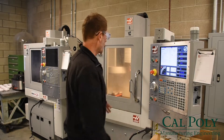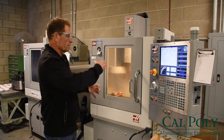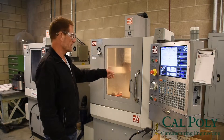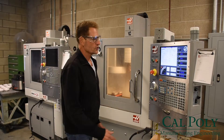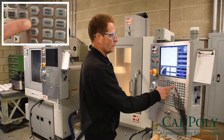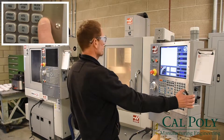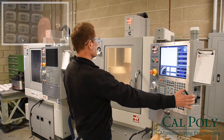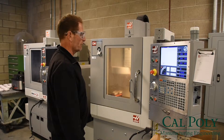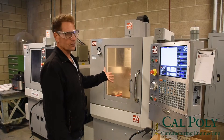Then we're going to want to remove the tool from the spindle so that while it's moving through all of its ranges of motion we don't have any interference between the end of the tool and, for example, the vise. We're going to go to the MDI button and then do an automatic tool change command in reverse, which will take out the current tool and put in the one in an empty tool space, essentially removing the tool.